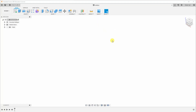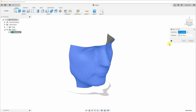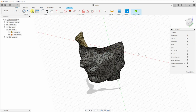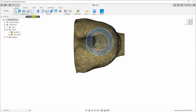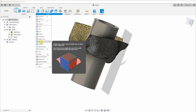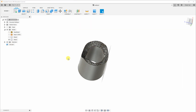Now let's see the quick design version. First, import the mesh, disable the design history, and convert the mesh to BRep. Then create a tube that will go through the mask. Split that tube using the face shape as a cutting tool, and the rest is up to you — you can design a thread at the end, but basically this end of the tube is perfectly aligned to your face.